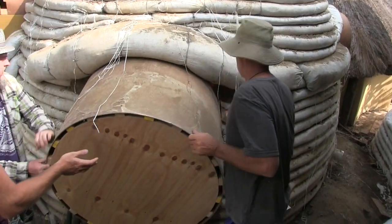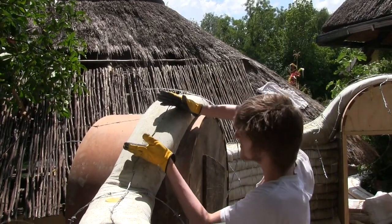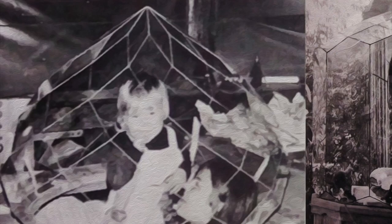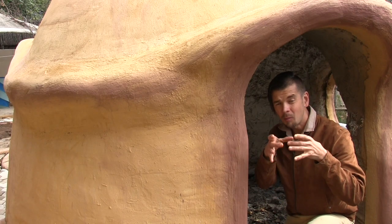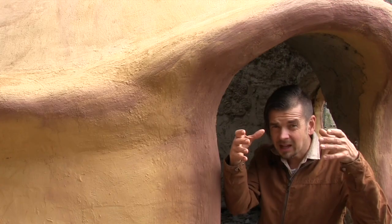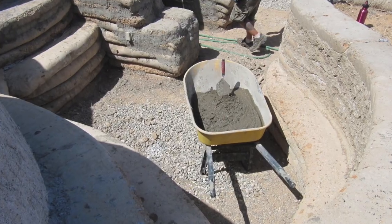And you will learn how to place the sandbags around the window arches, so you have the eyebrow stopping the water from entering your home, as well as the Air Crete structure. And of course, the sandbag domes with a barbed wire reinforcement in between each layer of the Super Adobe, sunken in ever so slightly with an extra bench ringing it on the outside.